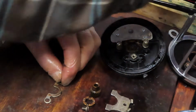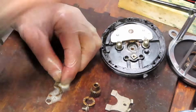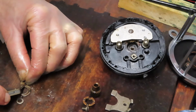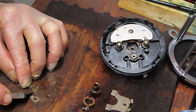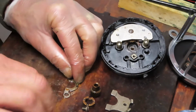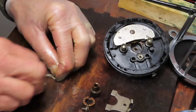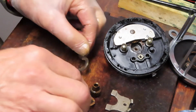I'm going to use a little bit of penetrating oil as a general degreaser there, and I'm going to use a blade of a utility knife to scrape off some of that hardcore grease that's dried there. You can certainly do this by just continuing to do the steel wool over time. It will wear it down, but that will expedite it. Okay, so those two parts are clean.